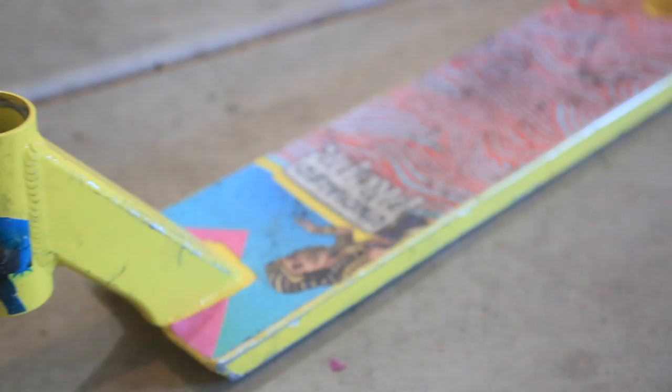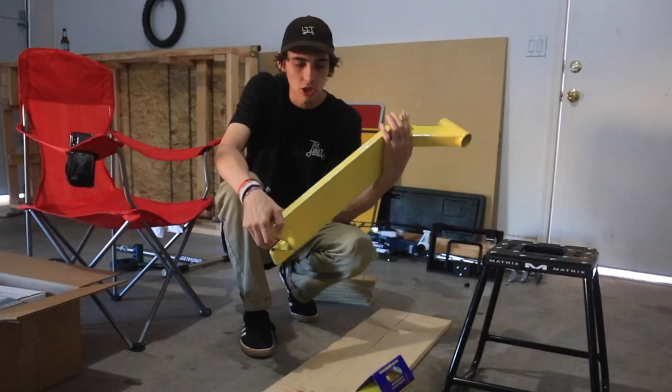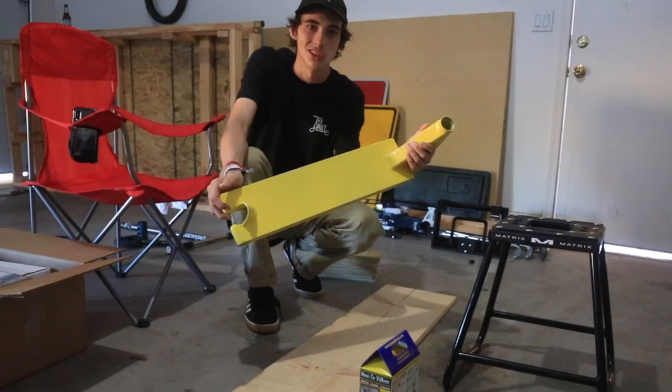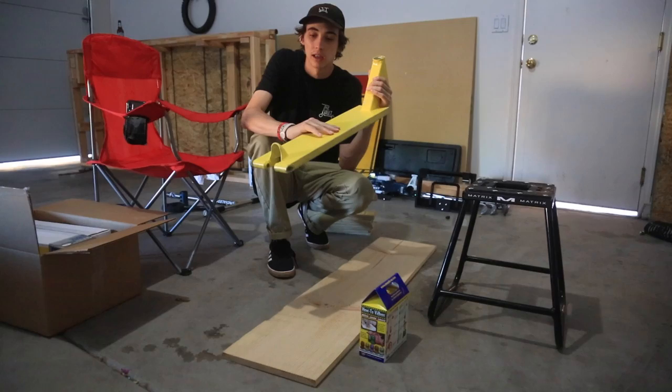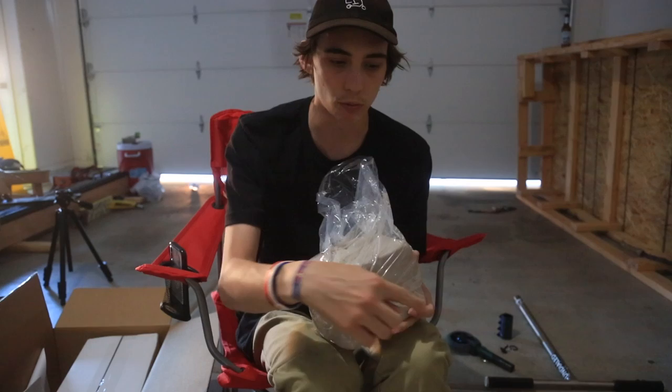So it's completely smooth. We have the deck — it has been washed so that way all the dust and everything is off of it. So the first thing I'm going to do is create the seam line in it. Basically what that means is it's the seam line that defines the top half of the mold from the bottom half of the mold. We're going to do that by putting it in some clay. I got my clay right here, big lump.